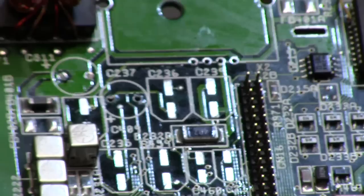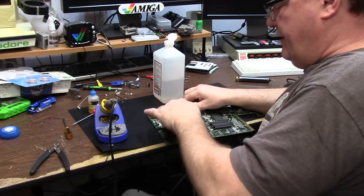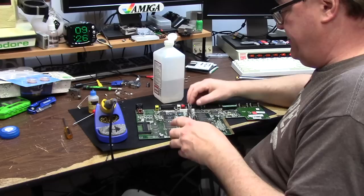It's the steps. It's the cut, relief cut the aluminum, remove the aluminum and the rubber, snip the two nipples, and the plastic comes right off. Debraid your little pegs, touch the pegs, get them off there, and debraid. That's it. 18 caps. You can be done in a little while.